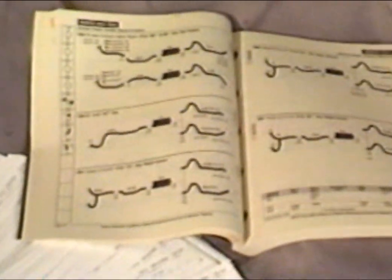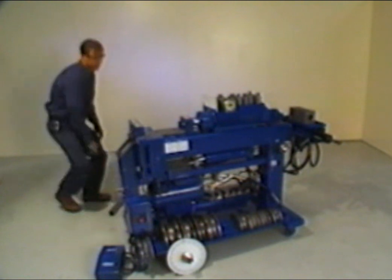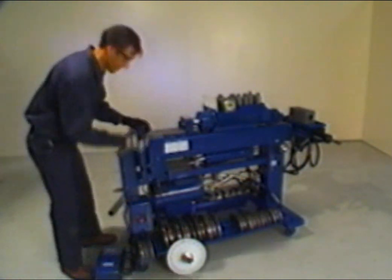First, look up the necessary card number in the appropriate reference catalog. The cards are filed in numerical sequence by the numbers shown on the top left section of the card. The last 4 digits are in sequential order. Exhaust pipes begin with the letter E, and tailpipes begin with the letter T. For demonstration, we'll bend the pipe found on card number EM5727.